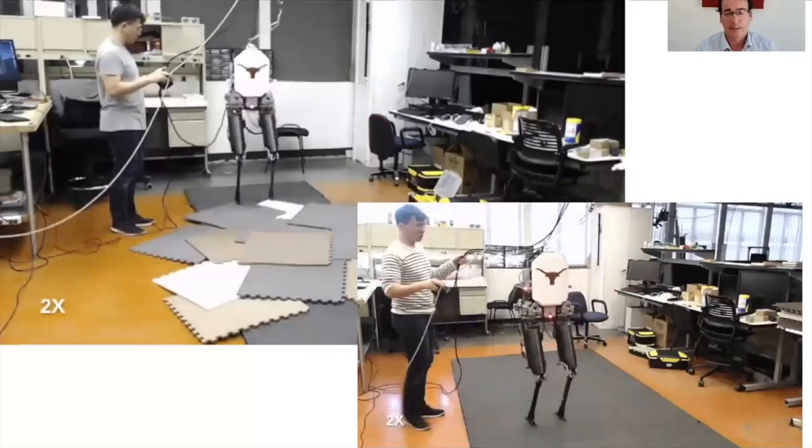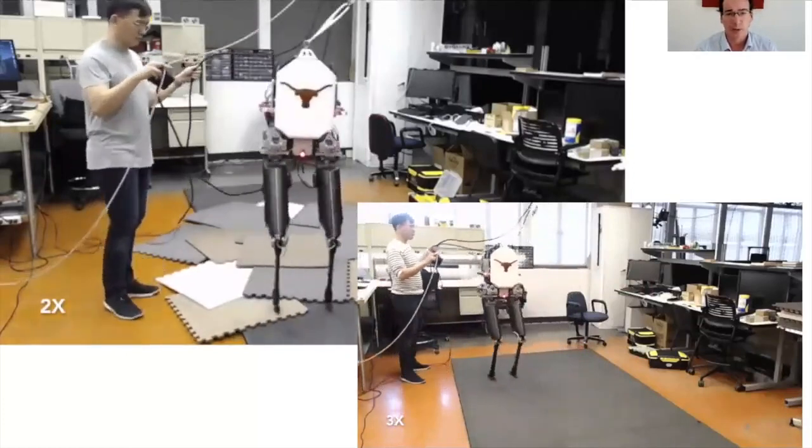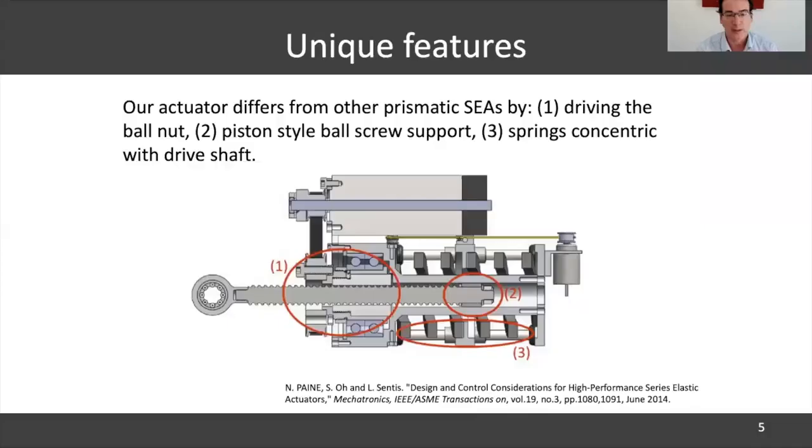Along the way, we made several findings. One of them is that, despite looking really nice, series elastic actuators do not result in high bandwidth position control. Quite the opposite — torque feedback eliminates passivity, and achieving good damping through joint velocity feedback is very challenging. Therefore, the torque sensing capabilities of SEAs were only partly useful to us. This makes a case for direct drive or low gear ratio, because they can provide good perception while still delivering adequate passivity, which is very important for position bandwidth.